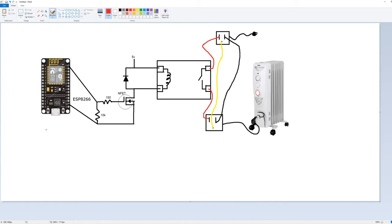And the last thing that we need to do is power the microcontroller itself. And it turns out that lightweight and cheap power supplies for something that runs on 5 volts already exist. And they're called phone chargers. So I'm actually just going to stick a phone charger in the box and hardwire it to power and plug it into the microcontroller.